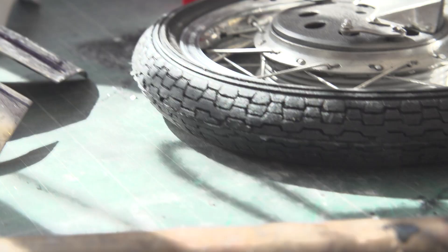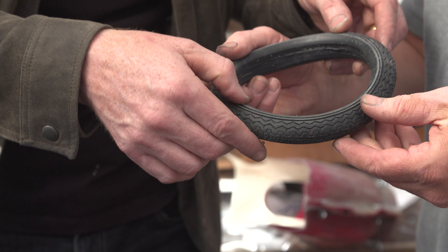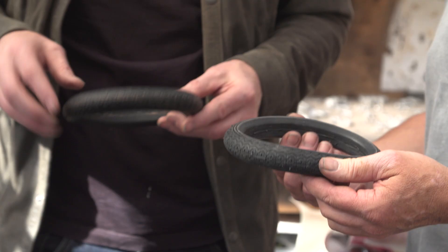And there's even lettering on the tire — the CC markings. How do you do that? That's done with appliqué — I get my friend at the sticker shop to make the stickers, you stick it on the master, it comes out of the mould. Amazing — you make a two-piece mould and make them in silicone. It sounds easy, but it took a long time and a lot of failures to get there.